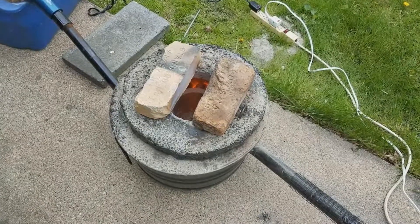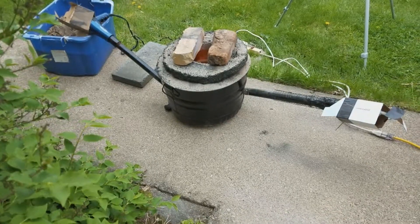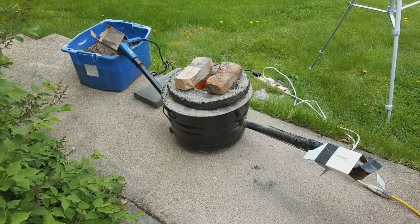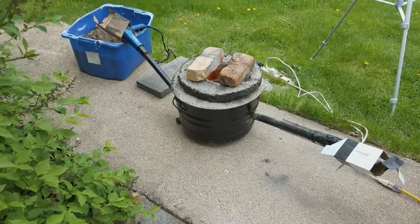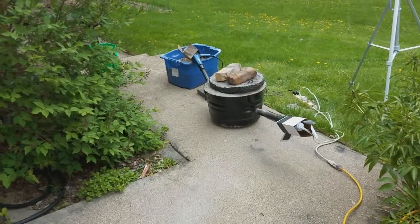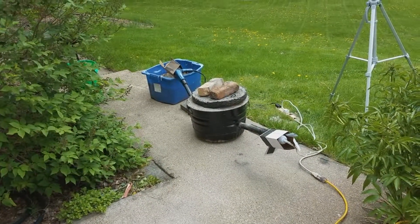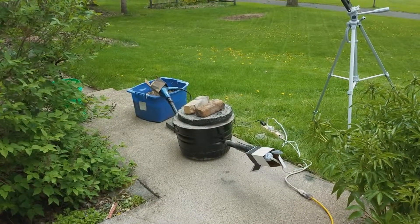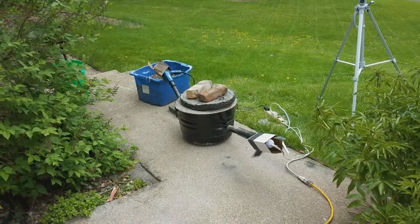I'm reheating it with the already half-melted borax in there and added some fresh borax. It's melting a lot better today — it's actually orange hot already. I made my forge a little big with a gap between the crucible and the concrete, so I had to put a lot more charcoal in, but starting lower and going higher works a lot better. The melting point for borax is about 1,300 degrees Fahrenheit, so to be safe I'm going to get it to around 1,400 to 1,500 degrees Fahrenheit so I have time to pour it around the crucible to cover the sides before it hardens.